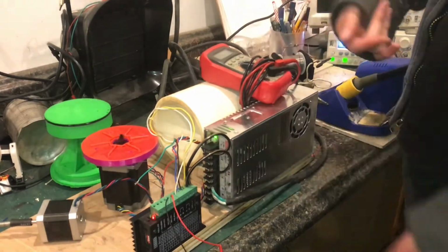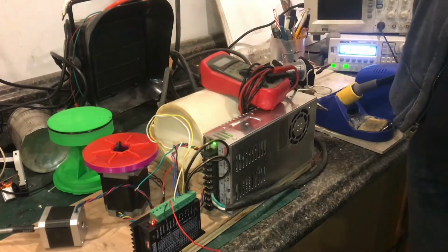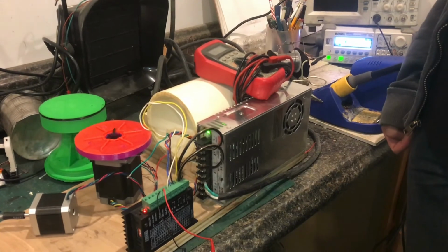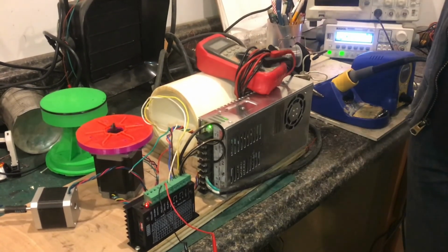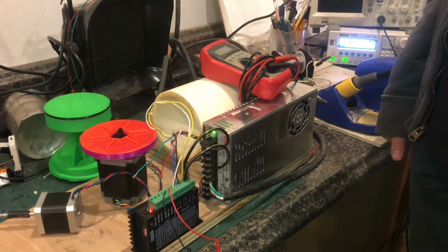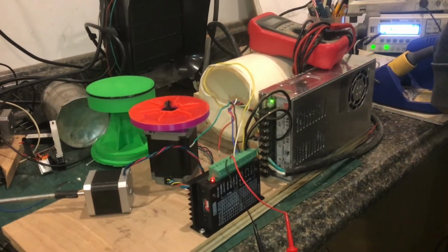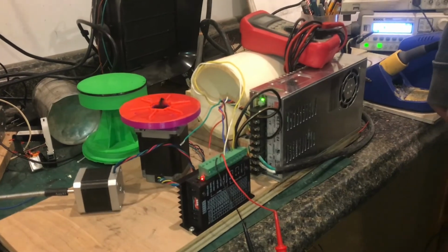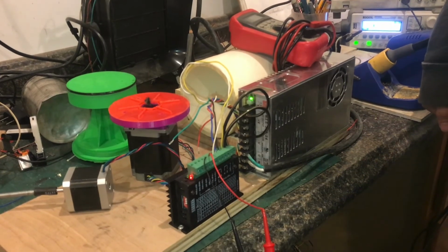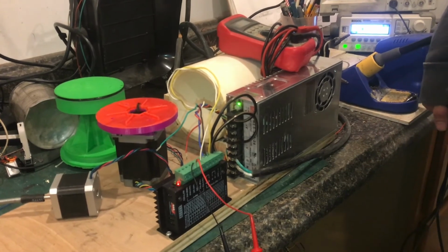But there's no denying that we were able to get a higher top speed. So if you had a nice acceleration ramp up of whatever machine this is moving or something, you certainly actually have the potential to move it much faster. Now the alternative is that in the other wiring configuration, the motor will be torqueier. It'll have more torque, even though it can't reach the higher speeds.